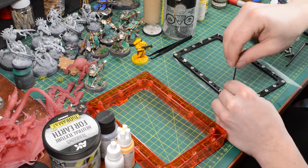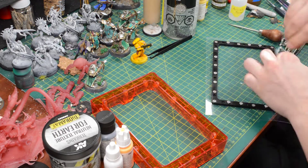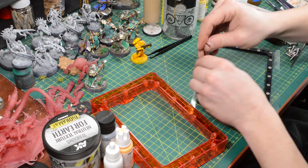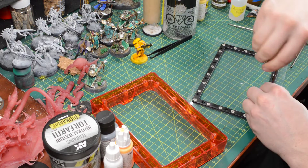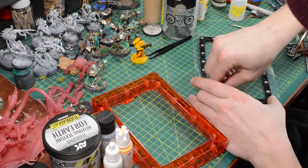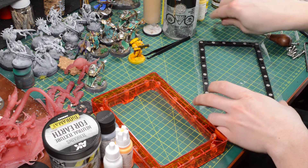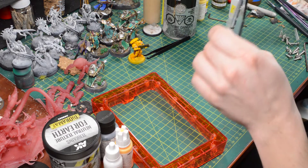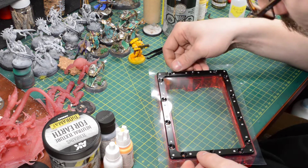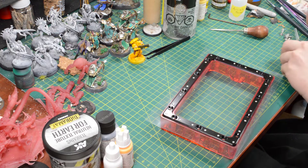You could actually just go from one side to the other — it really doesn't make a difference here. When you are doing the installation of the front red piece, that's when you want to do the differential tightening from side to side. Some vats' instructions on this film say to do the tightening as you're installing it. The ring stretches the FEP as you tighten it down.